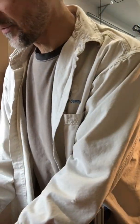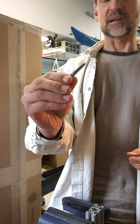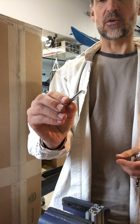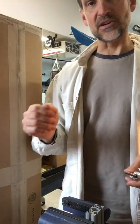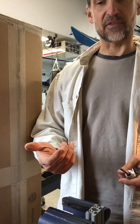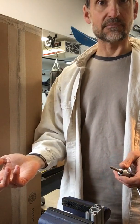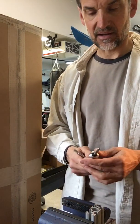Another one I've gone through as well — and this can also be done with a power drill — is essentially a power drill tap right here. Very strong, really good quality, and they have worked really well. But what I found is that if you break them and get them stuck inside the profile, you really can't get them out. You have to flip the profile over and use the other side, or basically discard that end, cut it off, and use it for something else at a shorter length.